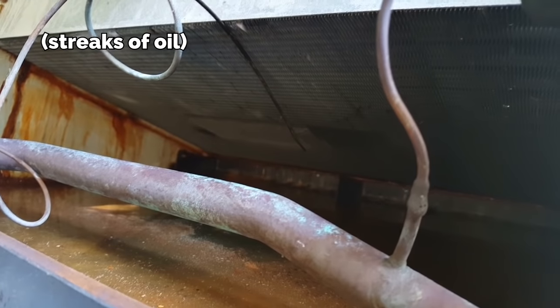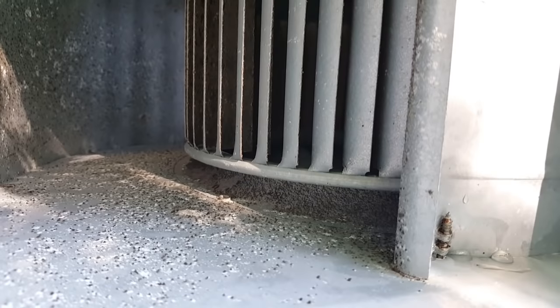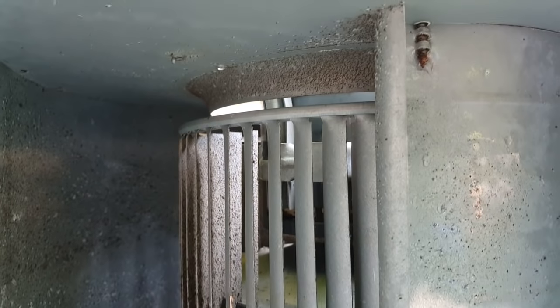There's our coil — take a peek in there, don't see long streaks, that's good too. For the looks of things down here, the blower wheel is not even — it's almost rubbing, and that'll cause some issues.